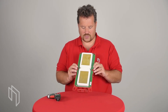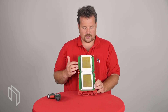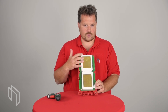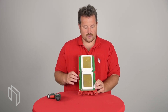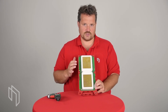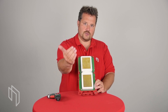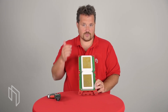So this is what it looks like inside. You can see we have two antennas — one is for transmitting power to the transponder and one is for receiving the signal back from the transponder. We intentionally went with this so-called bi-static design because it gives us the best possible performance in terms of sensitivity.